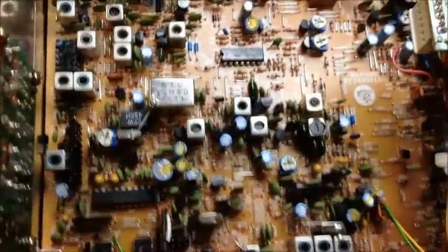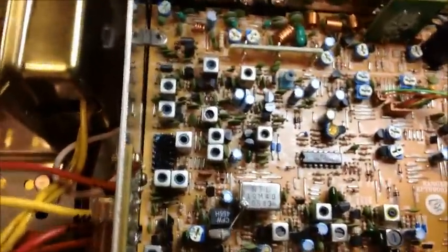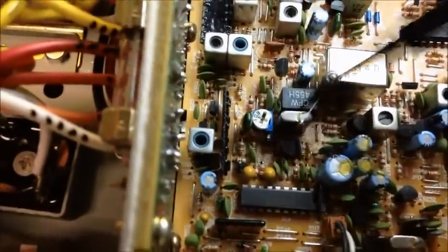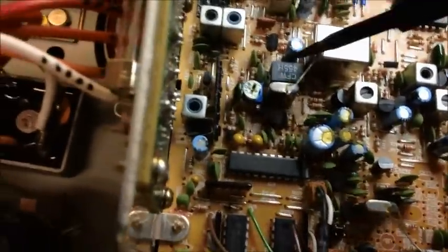Now the only other thing is he did get some type of receive mod. Somebody's put the Schottky diodes in here. They've changed out the main receive chip to a 222. The noise blanker, it's all been kind of changed out, but it's not been hi-fi. No cap changes have been done on this radio. I've gone through the whole radio, couldn't find anything else changed except for those few components. Plus, he still has the stock filter in here, the 455H. You know, if you want to go 6 kilohertz wide, you're looking for the F.